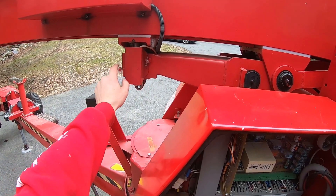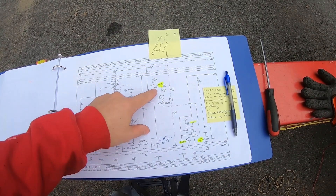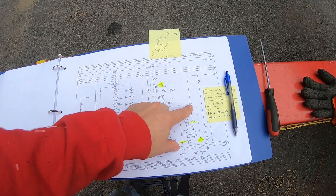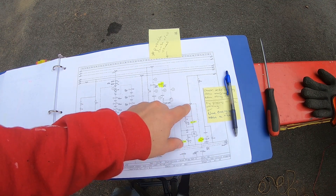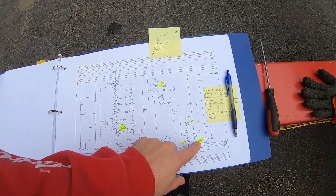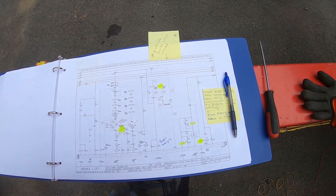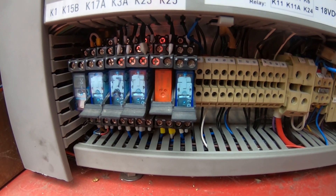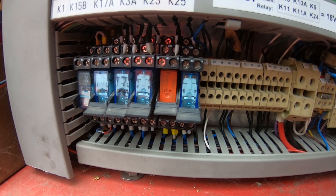Now I have to prove that this is actually bad, but we've isolated things here. Moment limit one checks the motion range limit switch. It flows over to U1, U8 terminal, which we just checked — it had zero voltage. That's where we applied 24-volt positive energy, which is what moment limit switch one would allow to energize relays K25, K13, and K7. These three relays — let's look at K25. That's K25 on the right, which is supposed to energize. The ones on the left are energizing when I turn the key switch on, but K25 is not.